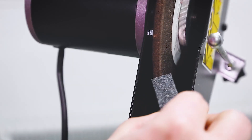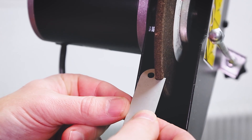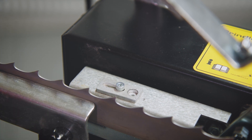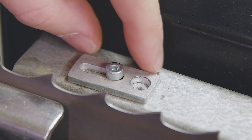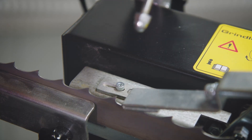When the grinding disc is new, as you can see it's completely square and needs to be shaped. Profile the disc with the profiler and use the template to check the correct shape. When grinding the front of the tooth and the tooth gullet, depending on the shape of the teeth on your bandsaw blade, you may want to adjust how the grinding head moves. That's why we have this small plate with a hole in it — it can be slid back and forth to adjust the movement of the grinding head.